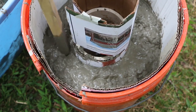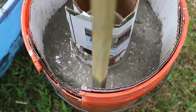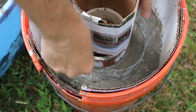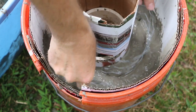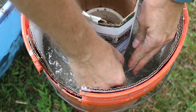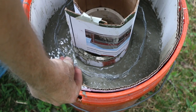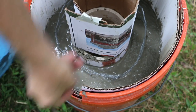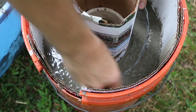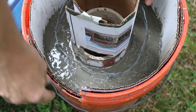The tamping also helps get bubbles of air to the top. Another layer of armature. Work that down in. This one I can twist. And since I'm coming up to the layer here where our firebox is going to go in, I'm going to bend down the front here of those two so that I'm not intruding into that space there where our firebox is going to go.